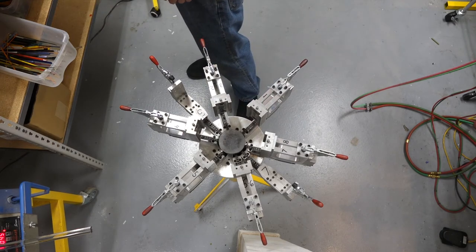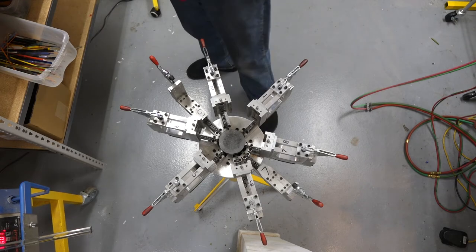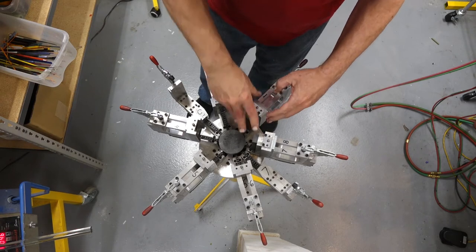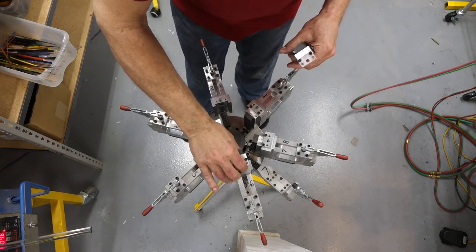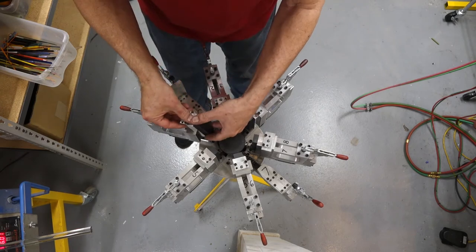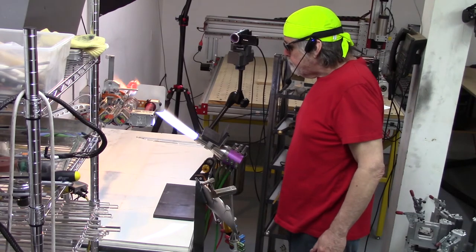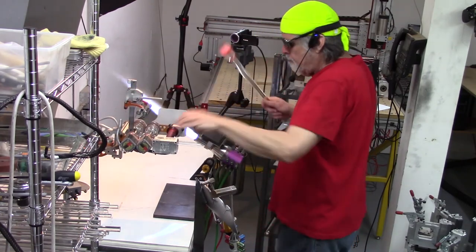And after the final squeeze with 7/8 dies, I'll put the other punty, the moil and the puller on the other end, and finish the pull. I don't exactly know what size my piece will come out to be, what dimension, and that's why I'm waiting until the glass is finished before I start work on the metal parts.